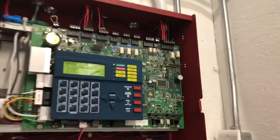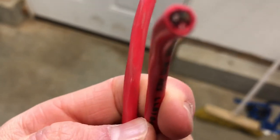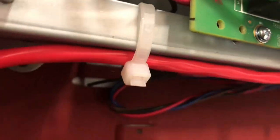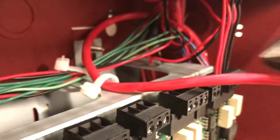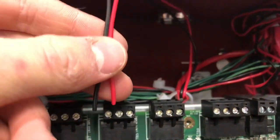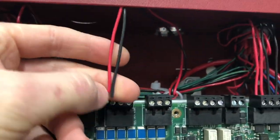I'm going to run some wire up through there, out of here, and into the fire alarm panel. I put this grommet in right here so it won't short on the panel or anything. Here's a small piece of fire alarm wire I'm going to be using — it's three-conductor, 18-gauge. Now we just have to strip the outer sheathing off, and once that's stripped, I'll strip the ends of the wires a little bit on both ends and install them into the terminals.